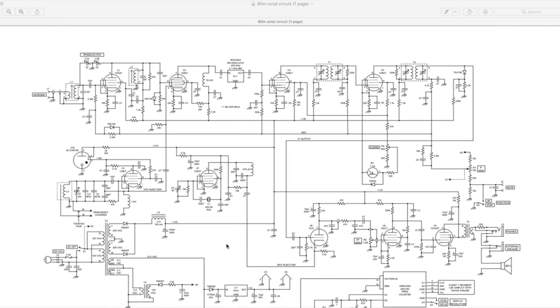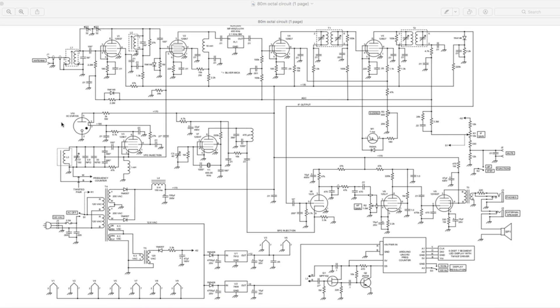I did make a few modifications to this circuit. First of all, this is designed for 80 metres, but I've actually added a couple more bands, so it covers 80, 40, and 30, and also a few of the broadcast bands within those regions. The other thing I changed was the product detector — this 12J5 or 6J5. All the valves I use were 6-volt heaters. So I've changed this to a standard triode double-diode detector. I've used a 6SQ7 rather than the original so I can listen to AM. And the BFO I've changed slightly because I didn't have a crystal — I've just used tuned circuits for that.